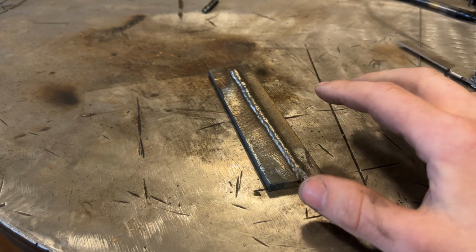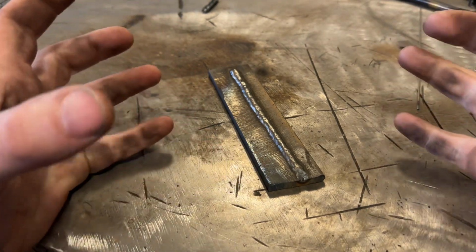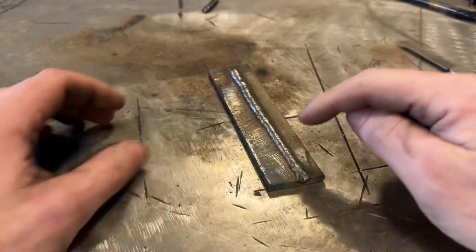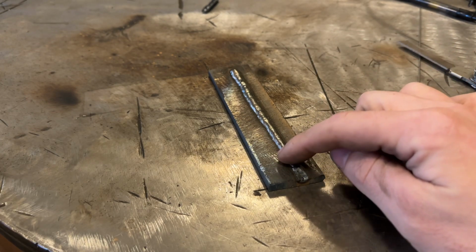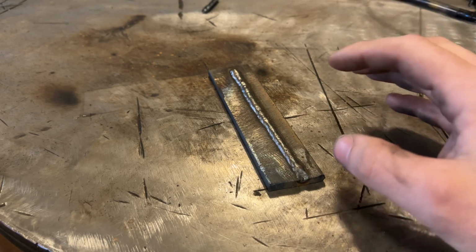So wear is one thing, but say you have a rock crusher, right? And it hammers big alloy hammers into boulders in order to bust them into smaller boulders. Well, the face of the hammer doesn't really need abrasion resistance as much as it needs impact toughness. So there are hard facing rods for that.